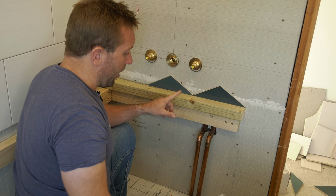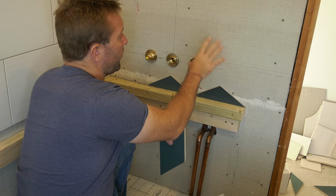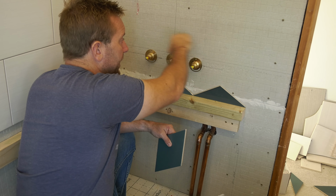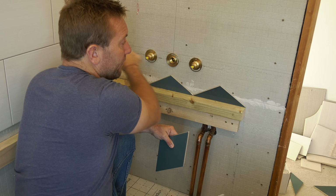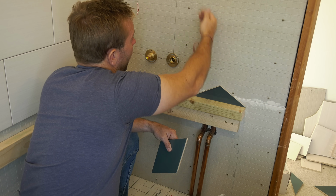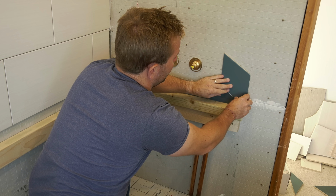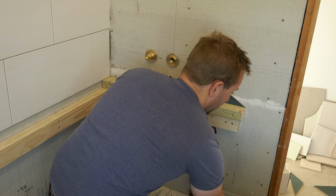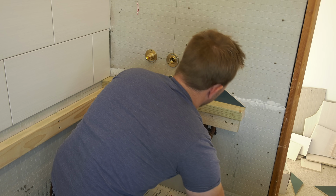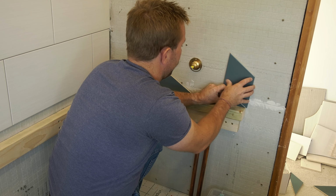Now we know from a half cut height what our layout is going to be, and what I'm trying to do is get to a point where I know above these taps here, so I can draw a line across there, maybe even put a bit of battening in, and then get tiling over the tops of these. So I'm not 100% concerned straight away about the exact heights of these. Hopefully we can employ the ox tile system here so we're kind of held in position, you know.